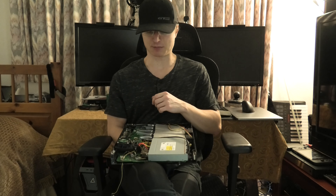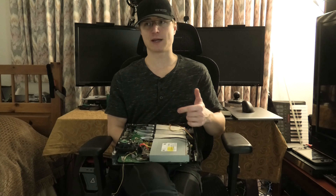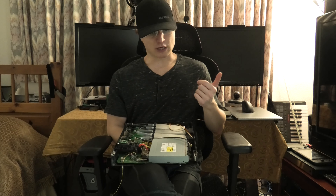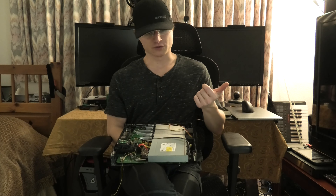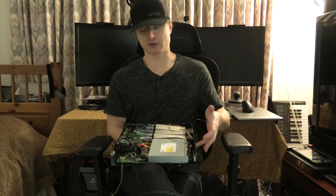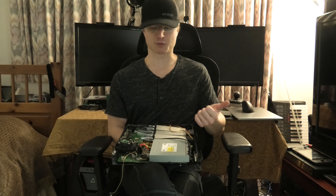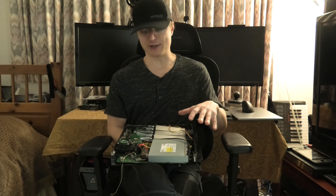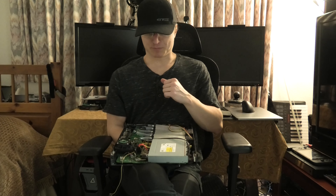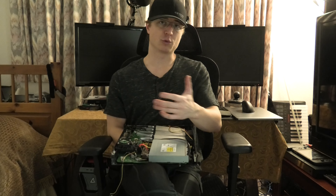At some point I may also end up moving the pot — the switch that allows me to control that voltage and amperage — to more or less the front of the case so I can adjust it remotely. But I'm not sure how well that'll work because I also need to move the antenna out front from the RF board so it can actually pick up controllers properly.